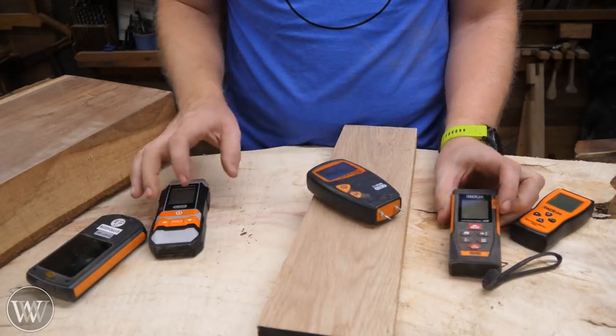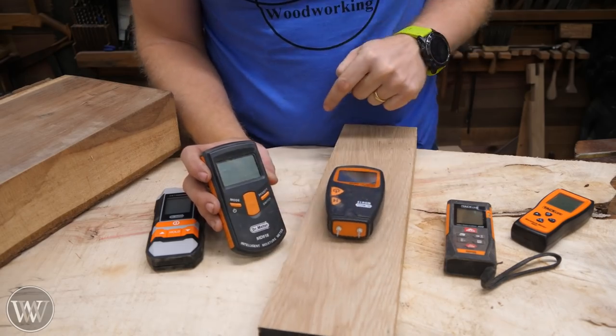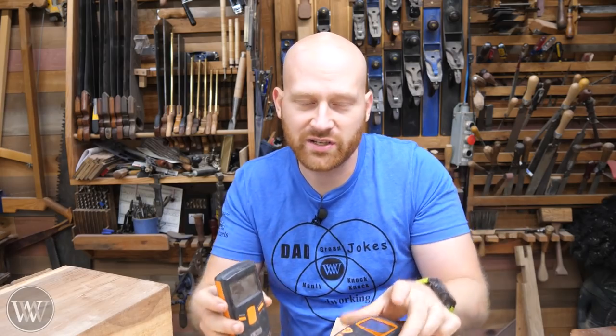This brings us to moisture meters, and I have quite a few of them here that I've collected over the years. A lot of people will tell you that it's dry when it reaches 9% — and that is a lie. The number that you read on your moisture meter is absolutely worthless; that number means nothing. Sometimes it will be dry at 7%, sometimes at 5%, sometimes at 15%. I've had boards which reach their natural equilibrium in my shop at 20%. And if you compare meter to meter and different location to different location, the exact same board will measure wildly different. So the number on the meter doesn't mean anything — just saying it reached 9% isn't going to tell me anything. I have to know about your shop, your meter, the type of wood — and even then I won't know because I've never been in your shop. Don't look at the number; just use it as a comparison, not as 'at this number it's dry.'